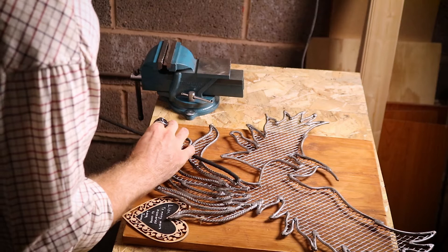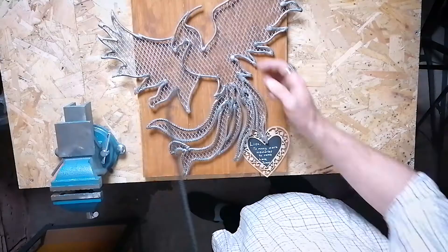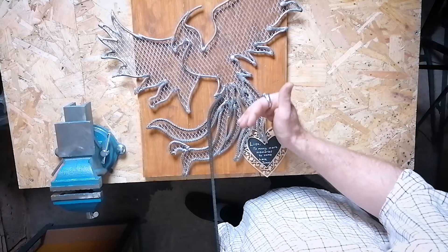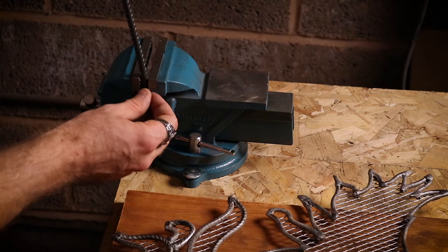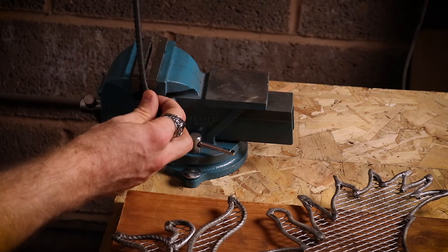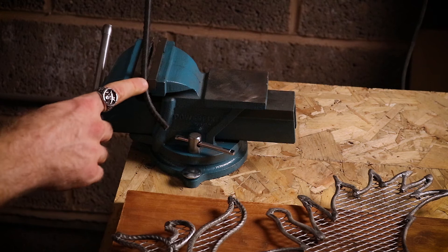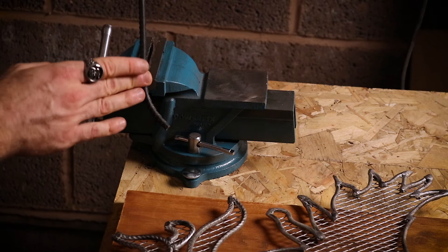So I've still got to go a bit further - back in, and this is what I said about doing it a bit at a time so you don't go too far. That's following the curve nicely up to the point where it goes straight, so that's where we need to start our next bend. This one's going to be in the opposite direction, which makes it a little bit more difficult. If we just put it in and bend the other way, the part that's in the jaw is going to damage that existing curve, so we need to be a little careful. We're going to have to clamp the corner where we want that sharp bend to start taking place, clamping just a very specific point that we want that bend to start in the other direction.